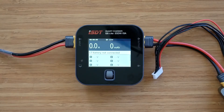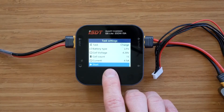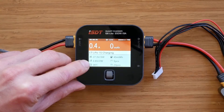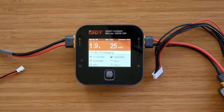However, there is a problem with voltage readings of 1S batteries on this charger. This one has been discharged to 3.74 volts, but if I plug it into the charger, it will show up to 4.5 volts. For some reason this doesn't affect the actual charging - when you start the task, the voltage will drop to the actual 3.7-3.8 volts. I charged a couple of 1S batteries using the Q6 Lite and the voltage is 4.2 volts on both, meaning it won't damage your 1S LiPos. However, this doesn't inspire confidence and it's definitely something ISDT has to look into and fix via a firmware update.